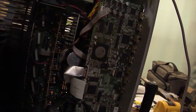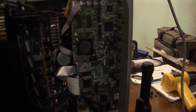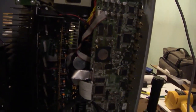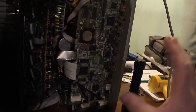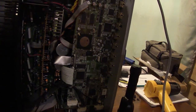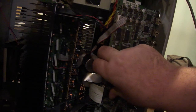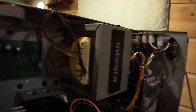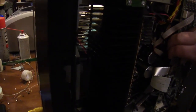So I'm sure there's parts on the back side. I don't know yet. I haven't taken it apart. This is the first time I've really messed with it. Alrighty then. The first thing that comes to mind, if it isn't lightning, would be broken solder joints. So I can flex this board and see. Got power off. Let me push on some stuff, warp the board a little bit here, and turn it back on. See if I hear any sound.